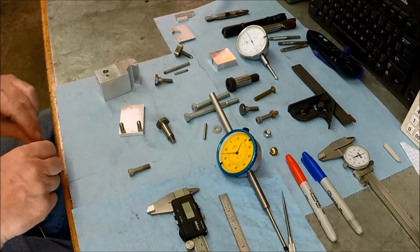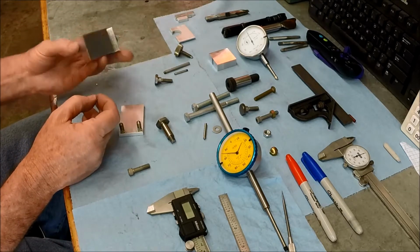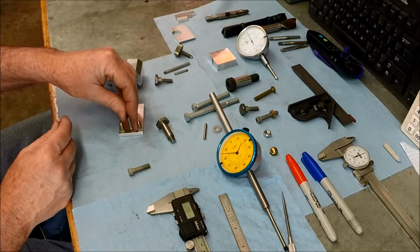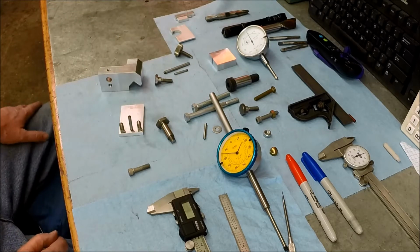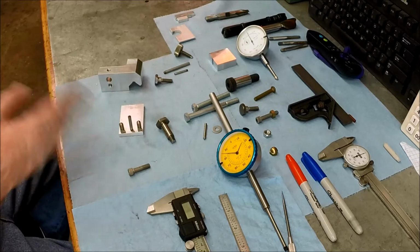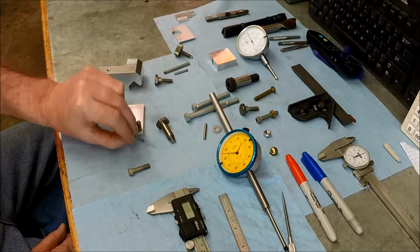And then I'll put this pin in the bottom here, if I can find the bottom. Here we go. Somewhere in this area, and I'll have it coming up through the plate with a slightly elongated hole, and that will keep the bottom plate from swinging to the side or rotating when you're tightening it up or loosening. So I got that thought.